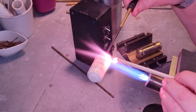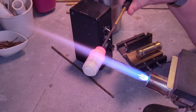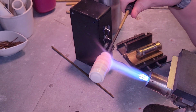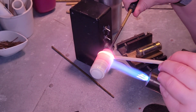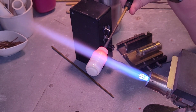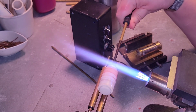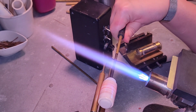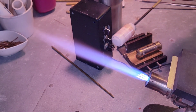You're just going to smooth the glass, hold it against the mandrel, and drag it around. Don't forget to heat the other end every once in a while. Checking the length to make sure it's where it needs to be.